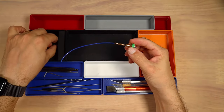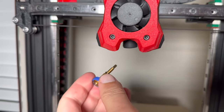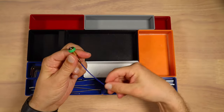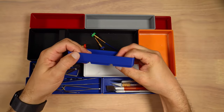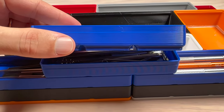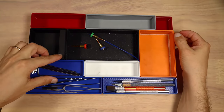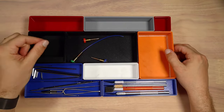To get the best results with overhangs, I recommend using a 0.6 millimeter nozzle and 0.3 millimeter layer height. I was very glad to finally use these nozzles I'd had in my collection for a long time. I also tried a 0.8 millimeter nozzle — in that case you get a problem where layer thickness is affected, and you get those tabs on the sides. If that's not an issue, the 0.8 mm nozzle at 0.3 mm layer height can work. But my recommendation is 0.6 mm nozzle at 0.3 mm layer height.